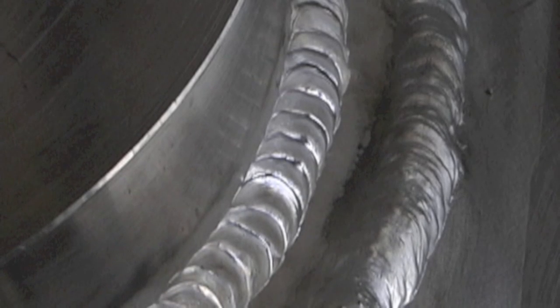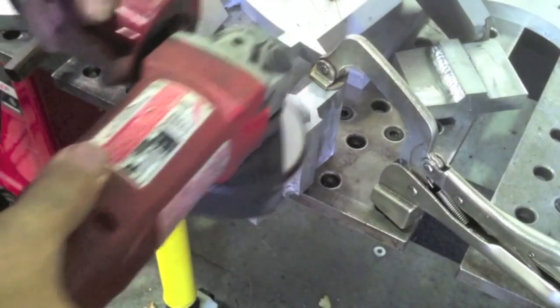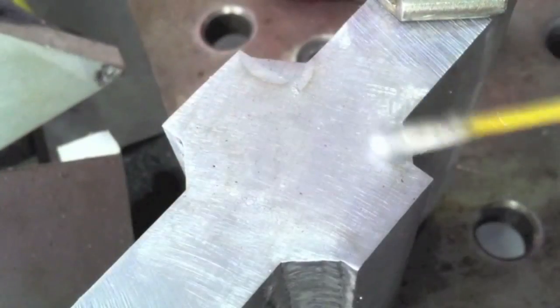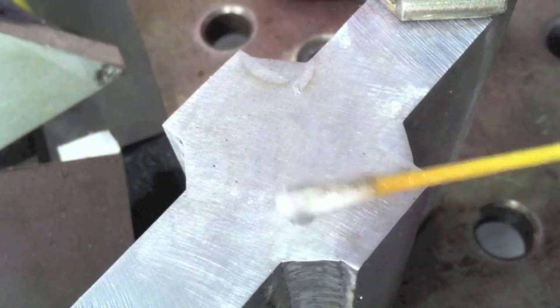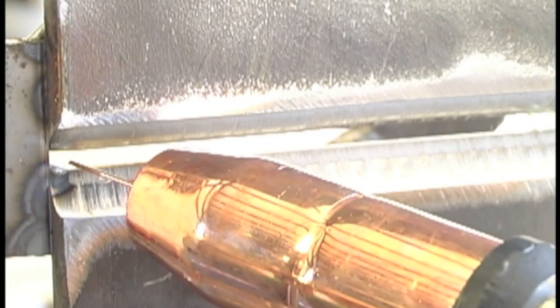There's even some aluminum MIG welding with a spool gun on a big thick heavy aluminum fixture, and vertical uphill MIG welding on three-quarter-inch-thick material — a two-pass weld with a little weave after the root pass. I also talked about how to slice, dice, polish, and etch welds to determine whether you're getting good quality penetration, including a Q-tip swab etch to differentiate between weld metal and base metal. General joints like lap joints, open butt V-groove, and horizontal joints — tons of stuff.